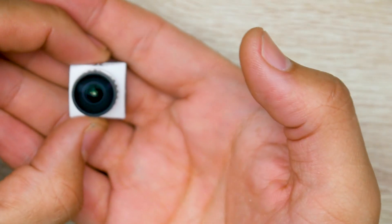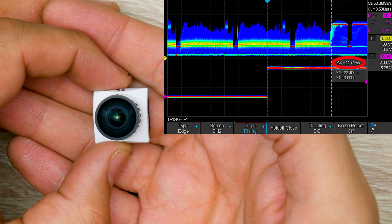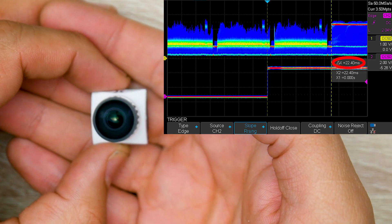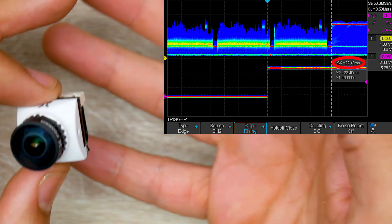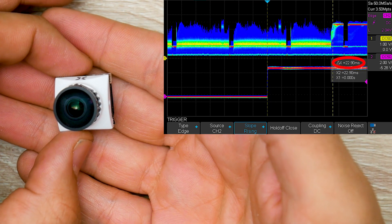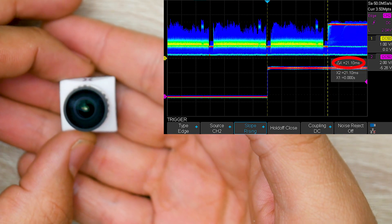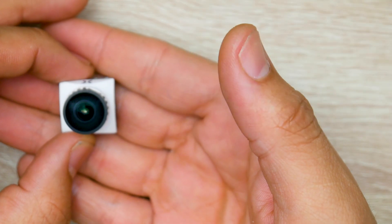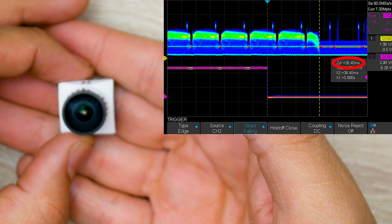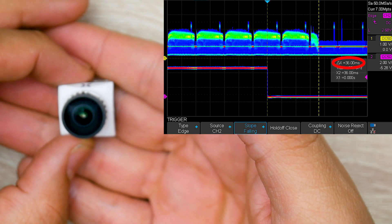For the latency testing on this camera, it's pretty static — it doesn't fluctuate that much. With the LED turning on, it was reaching roughly 22 to 23 milliseconds. However, once we move to the LED turning off, that's where we see a big spike. We can't really call it pure latency though — it's more the exposure and brightness levels being adjusted by the wide dynamic range to get the best picture. It is kind of slow though: from 22 milliseconds it jumped to roughly 34 to 36 milliseconds, but when it actually registered the LED turning off it was roughly 24 milliseconds.